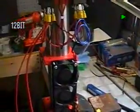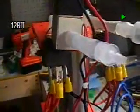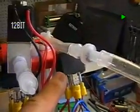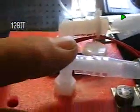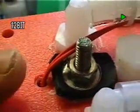Here we go with the Series 9C Supergen. As you can see, it's rather involved. As with our usual ones, we have a power relay; over here on this side we have the controls relay. Here's our water solenoid. We come over here and here is our water in for our reserve tank, our fill-in viewport, our HHO gas out, and down here — if you look closely — there's the wire that goes down into the level sensor below.